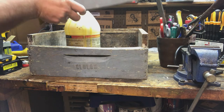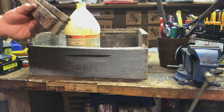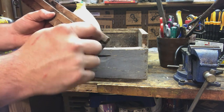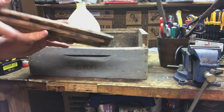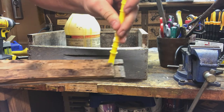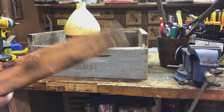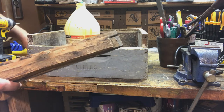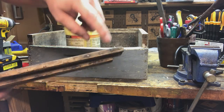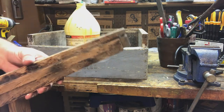We're gonna set this guy on all gentle-like. Okay. See, we have some concern, like over here. Yeah, there's a tiny bit of rot in there. Push some of the crud out of the cavity. That looks like a case where wood filler will help us out. Looked like he had that problem before, because you see how he has these small nails that he knocked down in here? I think it was to kind of secure and fix that crack.